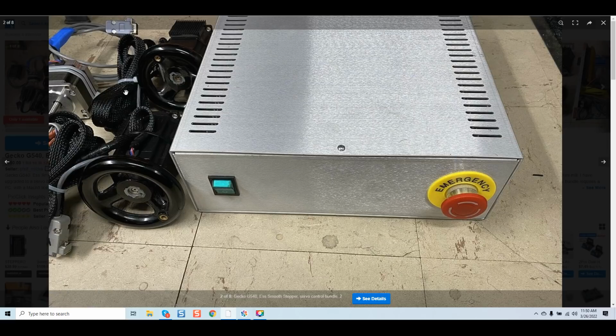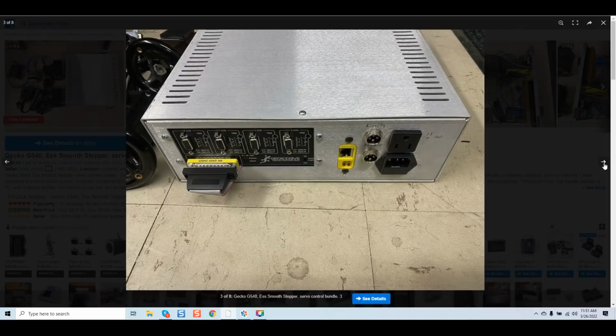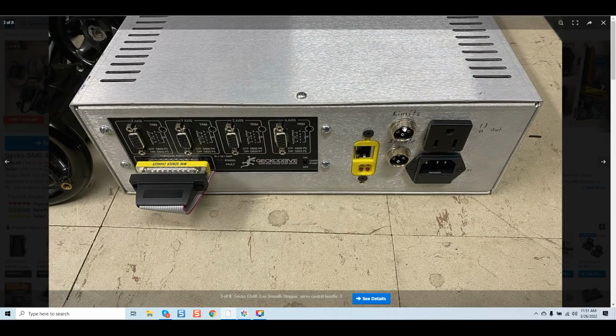When I see this, it already tells me that we're lacking real competence of what we're working with here. This is not a PC we're working with. We're not trying to make these leads really pretty. If anybody tried to run these cables with these guards around them, these twines, you're going to find inside a cable chain you're going to have a lot of problems. So that already tells me this is not best practice. As we move forward, this is where things get interesting. He's got limits right here.